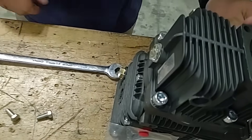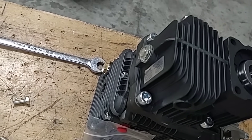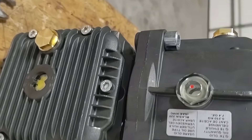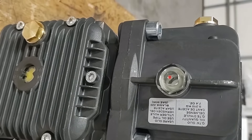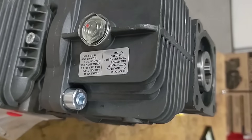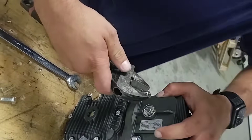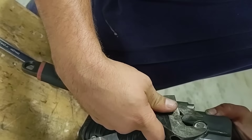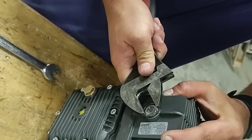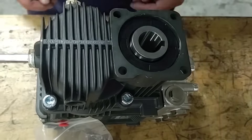For the sight glass, I take a Crescent wrench — you could almost do it by hand, technically, and get away with it. But we're going to use a wrench. Just a little bit of snugness, and that's it. If you go too tight, you're going to roll that O-ring out and it's going to not do its job.